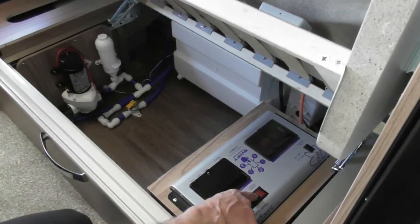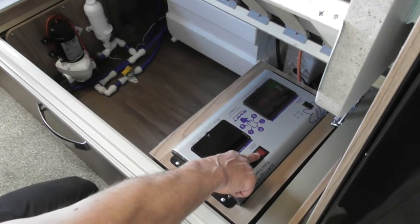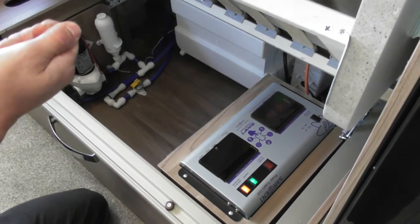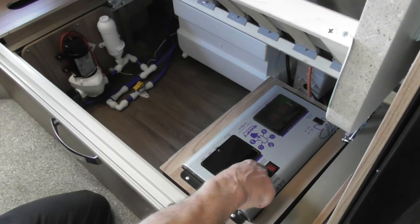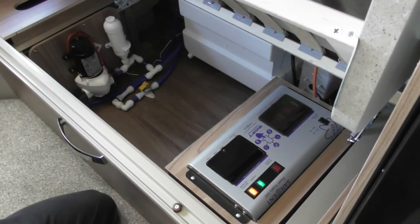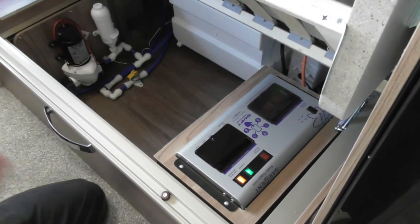Okay, then, we were talking about reverse polarity on the Continent. That is an indicator light. So you plug your electrics into theirs, come inside and have a look. If that has lit, that means it is reversed. You're going to need an adapter to operate it from. It won't hurt it. It won't damage it, but it won't sort it out. So you need to get an adapter to change it.